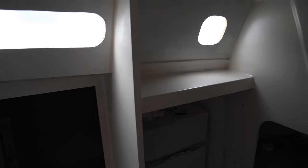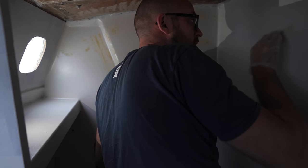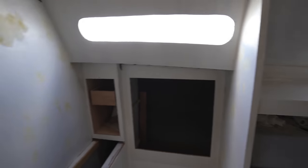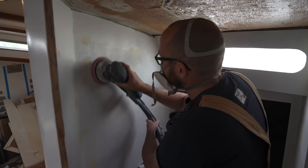Overall things are looking pretty good in here but pinholes are a right pain in the behind. There are some down here, a couple up there, some right here. I absolutely hate working with the 407 fairing filler — I always get little pinholes and it's just really annoying. But fortunately the cure is pretty straightforward: I just have to go over all of the surfaces in here and wherever I find little pinholes I fill those with a little bit of polyester putty. As you can tell by my wonderfully clean pants, it is now the next day and it's time to sand that little bit of polyester putty from yesterday. There ended up being quite a few little areas.